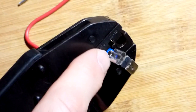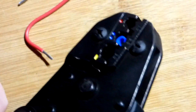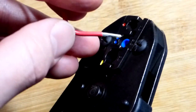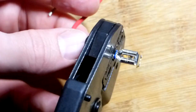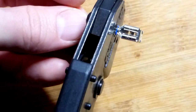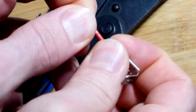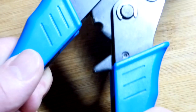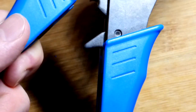To crimp the wire on, we want the opening for the 16 gauge — 14 to 18 gauge range — with the open side over here. I had to unbend this a little bit. Since it's upside down, we're putting the wire the opposite way, sliding it through. You can see there's wire there — just keep squeezing down and it will release once you squeeze all the way. Hopefully we have a good connection — and we do. With this crimping tool, if you start ratcheting but need to open it, just press that lever to release it.